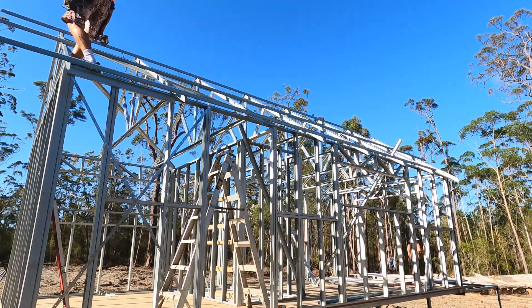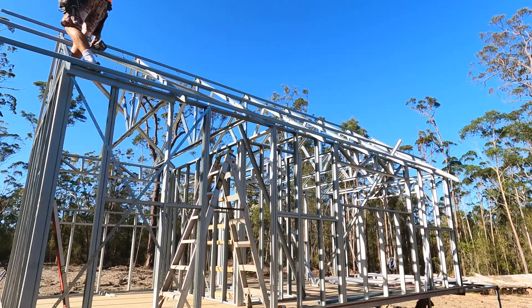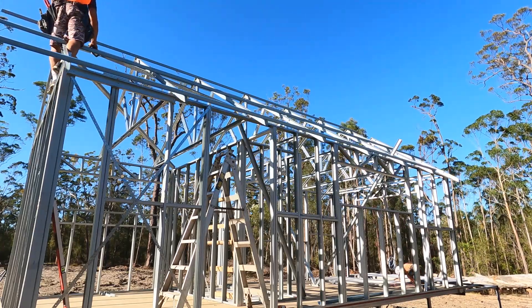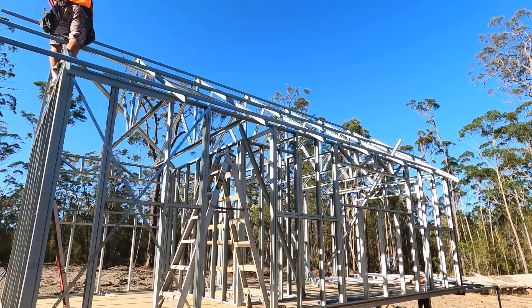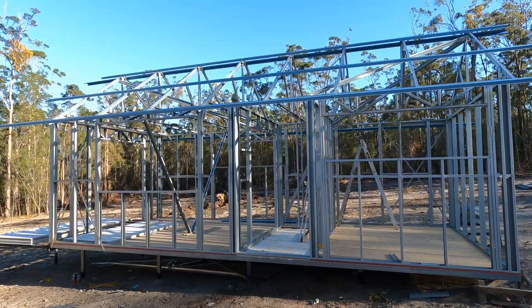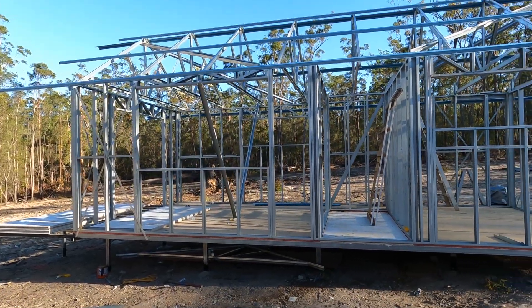You've probably also noticed I've got a lot of overhang on my battens hanging off the end of the building. I'm going to have a little eave over the end of this gable just to help keep some weather off the end of the building. These battens are hanging out as flyers — after I get the other side on and get a nice straight mark through, I'll cut them back to length.